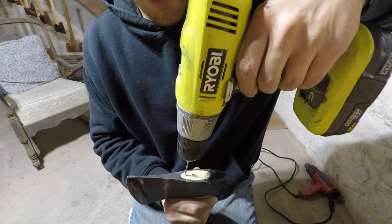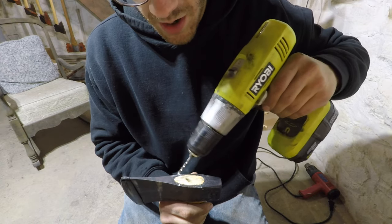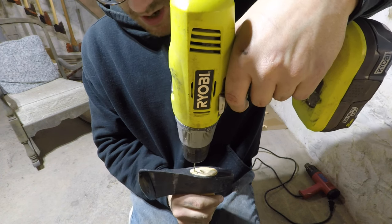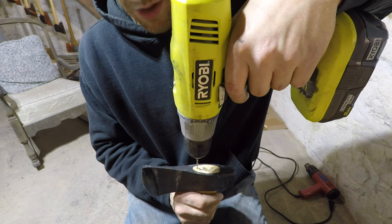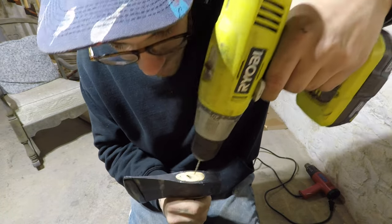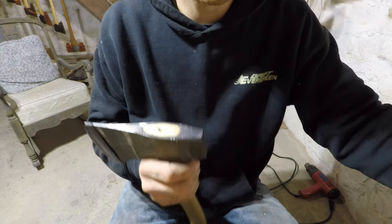You want to try to drill as straight as possible because if you kick off to the side you're defeating the purpose — your screw won't go in that far, and you'll end up drilling into the eye metal portion of the axe head, which you definitely don't want. Try to go as straight as you can and pilot drill this out. Depending on your application — this is a hatchet so this eye isn't that deep — you're not going to sink the whole drill bit down in there; you're going to go maybe about a half inch, not even. Those are your pilot drill holes in the wooden wedge section.